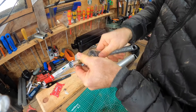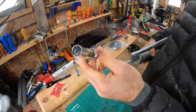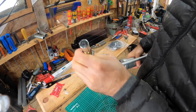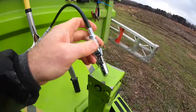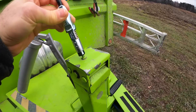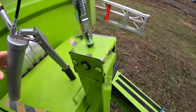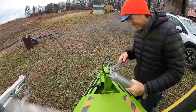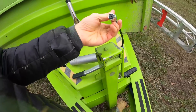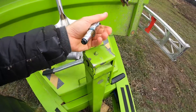On my other guns, I've always just kind of tightened this up just a little bit, just to keep this thing from coming loose. All it allows you to do is simply and easily couple and uncouple from your fittings. So we got the unit on the grease gun. To attach, you just depress the thumb and you can attach to your fitting — just flop right over it and let it down, and you're locked in. And then to detach, you just pop it off and you're done. Instead of struggling to yank these guys off all the time, it's just an easy connection.